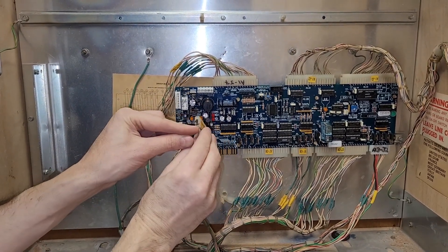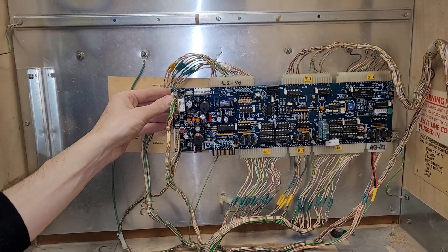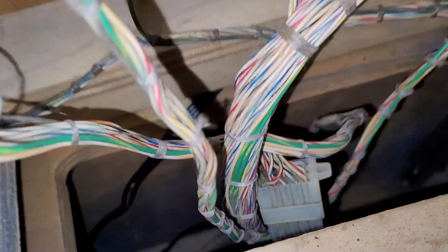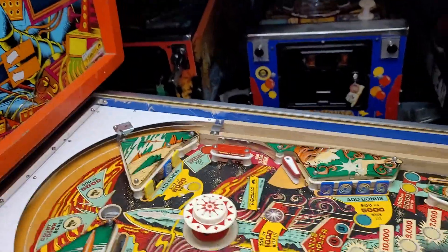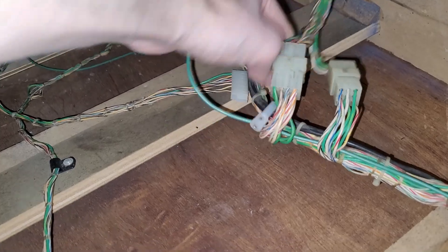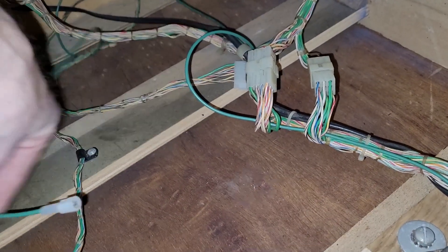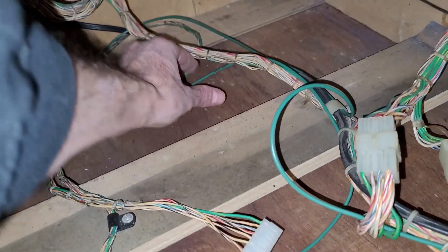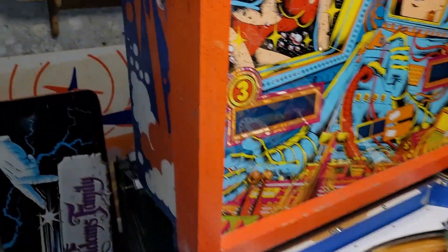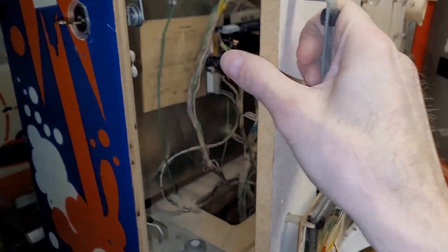And this arrow — that's a one? Or is that like this side up? One, one. Yep. What about J14? Is J14 used? Let's look in the neck here and see if we can see anything. You see anything else down there? We can always lift up the play field. Let's lift up the play field and see. I thought all those connectors are used. We do have a ground wire here that we want to feed up into the head. And there's the other connector — J14. Nice, we found J14. So let's feed those right back so we can access those. And we wouldn't have found that ground if we wouldn't have looked for J14, probably.